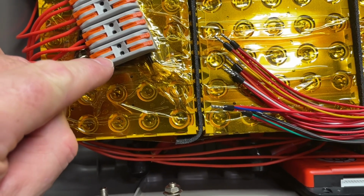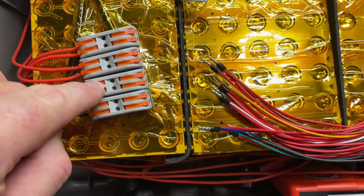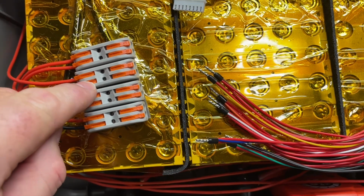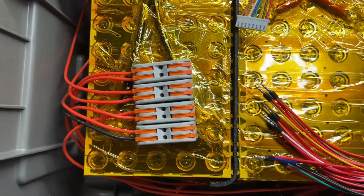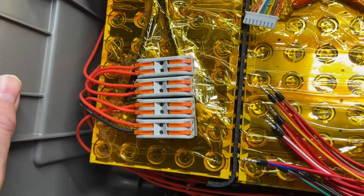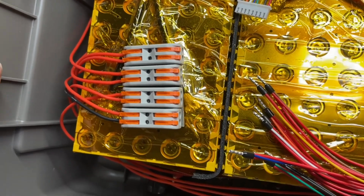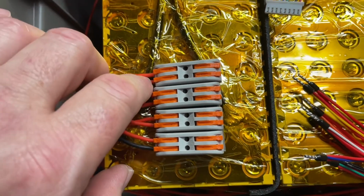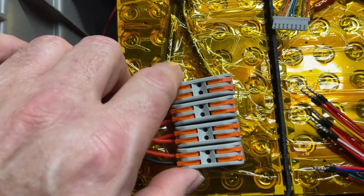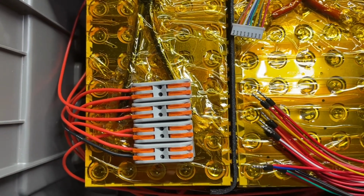Between these, it'll be your 4 volts, your 8 volts, 12, 16, 20, 24, 28. So they increase the voltage of each of the individual cells. If for some reason it goes too high or it's not high enough, then we've put our balance leads in incorrectly. And like I said, we need to check this 3 or 4 times just to make sure, because this will destroy our active balancer or the BMS if we do not have this wired correctly. So let me go ahead and take care of that.